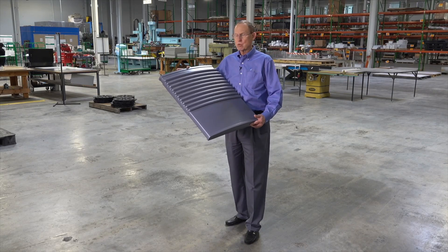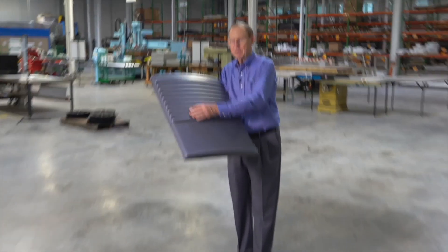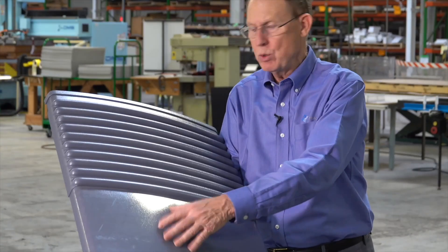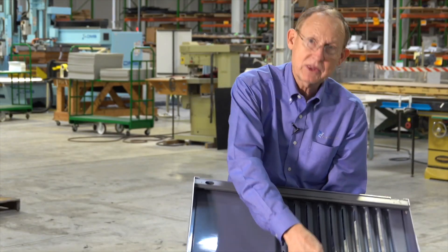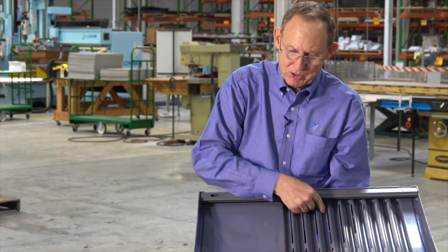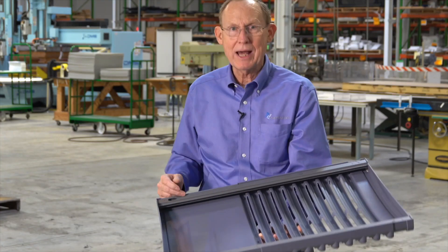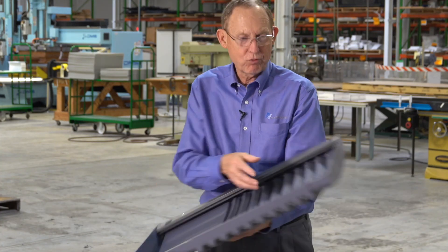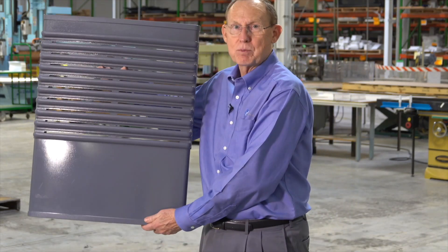This is the front of an ice machine. What we have done is we've pulled this into a female tool to get all of this definition. You see the part is smooth here, and it's textured here. Then we flip it over, and we cut these ribs open on our CNC machine. We actually go in and weld this bracket on each side of this part, so that when this fits on the ice machine, it can just hang on the front of the ice machine.